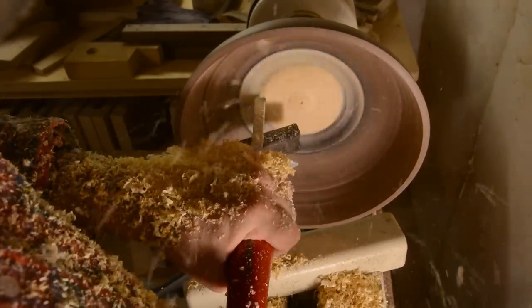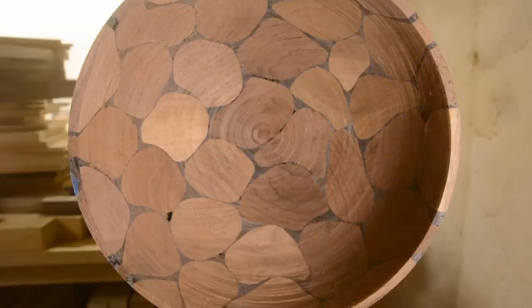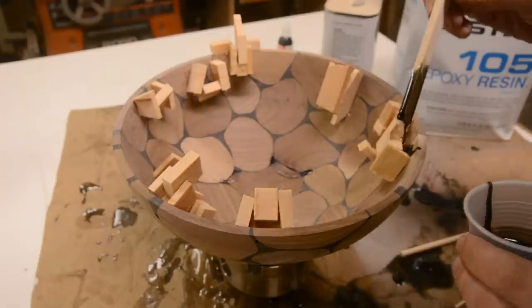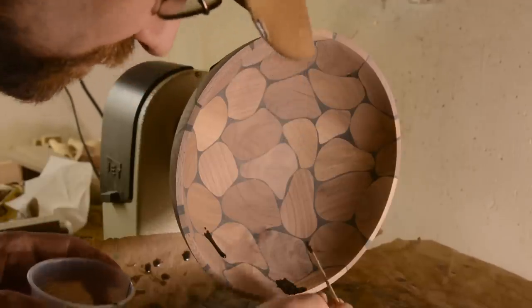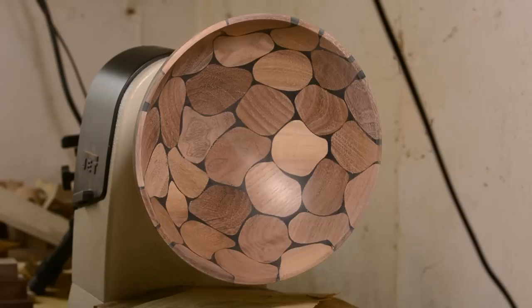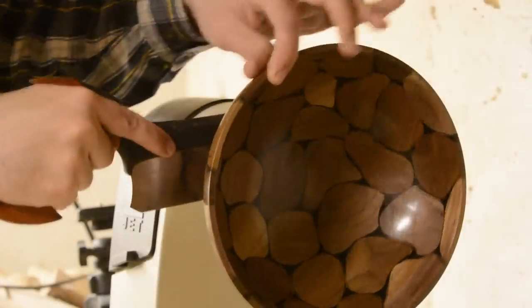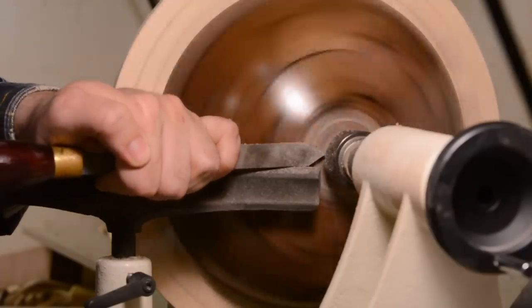I'm by no means an expert turner and you don't have to be to do this project — it's just a question of how much time you're going to spend sanding to fix it. And I spent a lot of time sanding. This was by far my worst attempt at filling voids; they all leaked. Though I did get it to the point where it was just a few areas to address, and they were sort of in line with each other — one on the inside at the bottom would have one on the outside at the top, so I could concentrate on just those. At the end I was mixing up very small batches rather than a full pump. Eventually it got to the point where it was good enough, so I cut it off and turned around and finished the bottom.